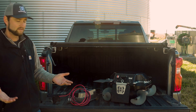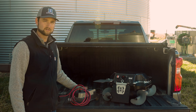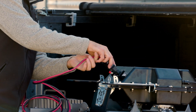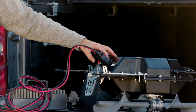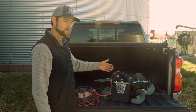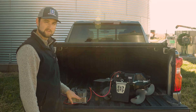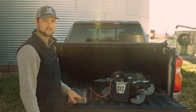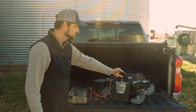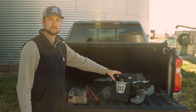To charge the robot it's very simple. Remove the dust cover from the charge port on the robot, plug the standard charger into the proper power supply, then take the connector and plug it into the robot charge port until it is seated all the way against the robot. Turn on the robot and charging will begin. Verify charge status on the back of the charger via the status LEDs — yellow indicates currently charging, green indicates charge is complete. Once complete, turn the robot off, disconnect the charger, reconnect the dust cover, and the robot is ready to go back into operation.